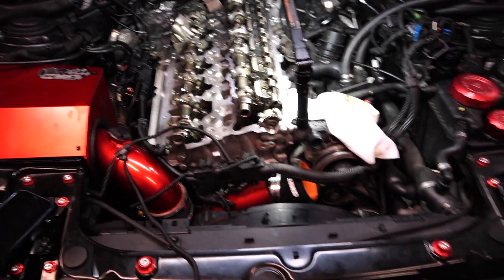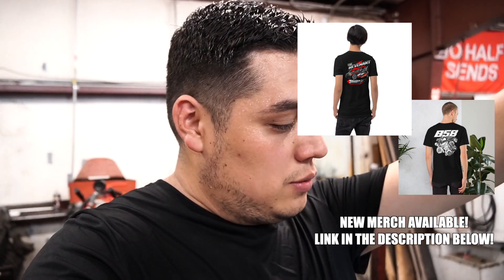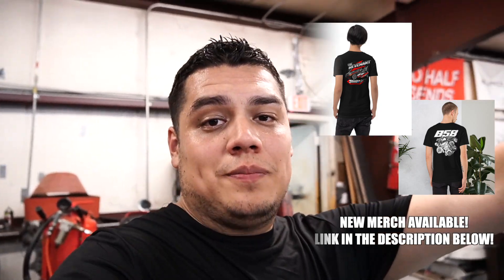Sorry, I lost audio on this part of the video. Essentially, when you thread the ports, don't thread them all the way in — allow yourself about an inch of thread, then use that to put in the set screws. This allows the set screw to bottom out and not go all the way down to the valves. Also use a generous amount of sealant but don't overdo it. You can also use thread tape and that will work just fine. If this video was helpful, go ahead and click like and subscribe and I'll have more videos like this in the future. Thanks so much!